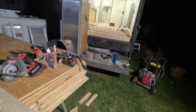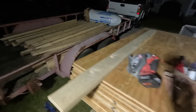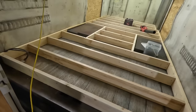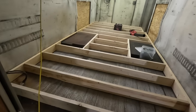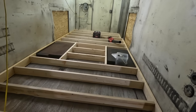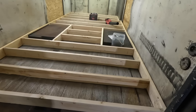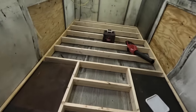Quick little update here — another night out here working under the lights. Got quite a bit done this evening. This is all my plywood for the inside, and all my framing material. Like I said before, I'm studding this thing out like a house because I'm insulating it like a really nice house — that's my biggest reason. I got the floor framed in tonight, worked on it for a couple hours. I got the side panels enclosed up too.